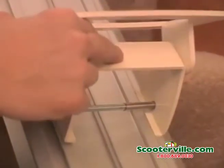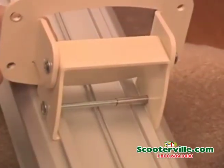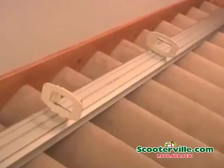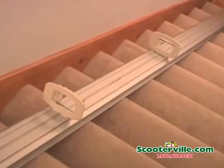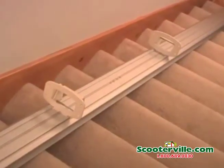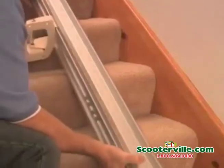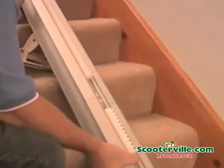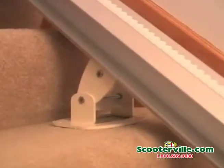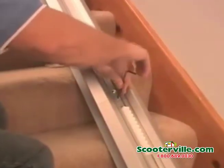Install the two bolts into the joint fastener and tighten with a 3/16 inch Allen wrench. Installing the rail brackets is a simple matter of snapping them into the rail channels. Be sure the brackets are installed with the screw side facing the wall. The brackets are tightened from one side only. For double rails, a bracket should be placed on the first step, one on each side of the splice, and one on the step closest to the landing. Turn the rail right side up. The bracket axle should be aligned with the nose of each step.